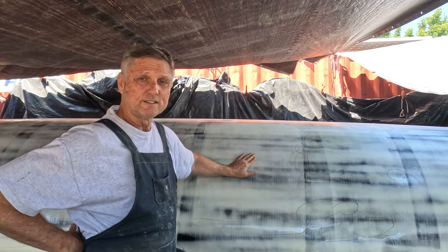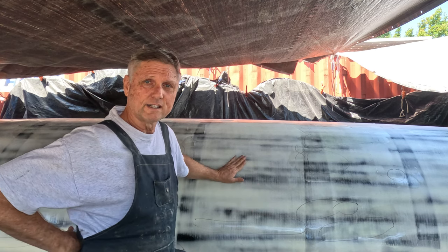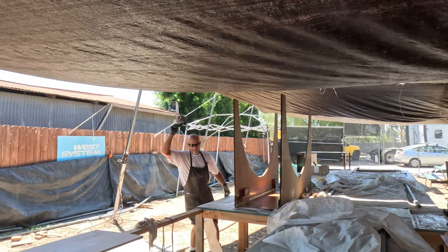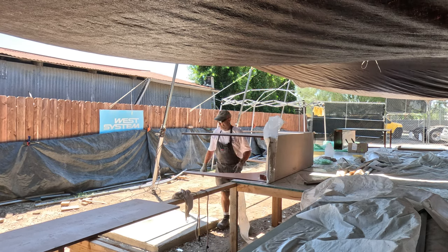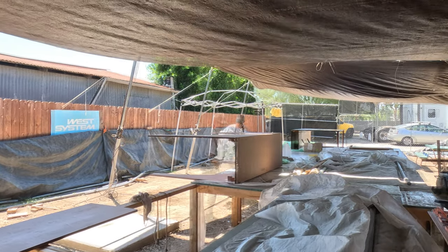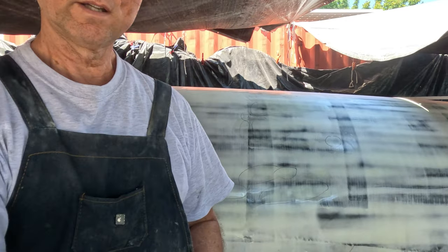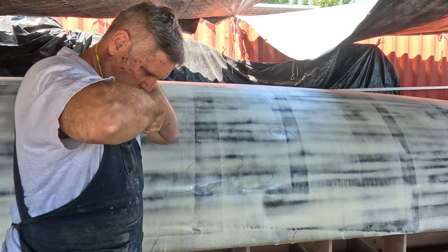Round two of that patching will take place tomorrow. Today I'm sanding all the way up the hull — about a third to go on this side, then I'll go down the other side. I'll sand all day today and get to putting more fairing compound on tomorrow. Meanwhile, Brian is working on the forward cradle, getting the layers of fiberglass on the inside and outside to strengthen it up. He'll get that one done today while I'm over here with the flexi sander.